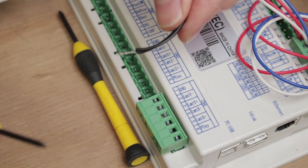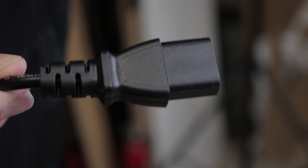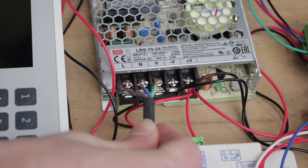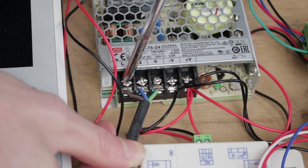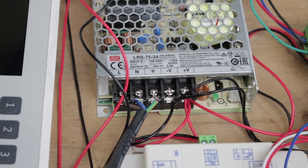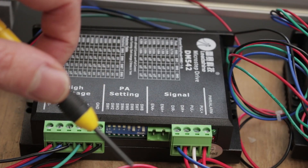So now I can run the wires from the limit switches into the control board. The last thing to wire in is the mains voltage to the 24-volt power supply. I've taken a regular jug cord — the same as what goes into the back of heaps of different appliances — cut the end off and stripped it to show the wires inside. This is different for different countries so triple check first, but I have live, neutral and earth. Before I plug this in and everything starts running, I need to check the settings on my stepper driver. These little switches control amperage to the motors and how far they will spin on a single signal from the controller.